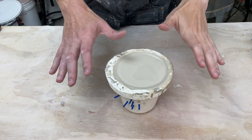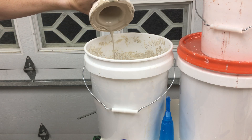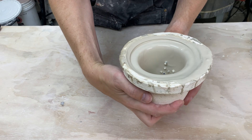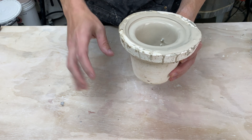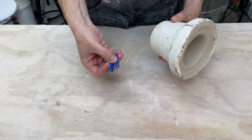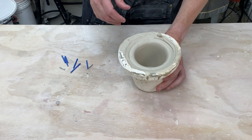The walls have set up — now for the moment of truth. Let's dump it out. We've got a little bit of build-up but it's not very much. I'm going to turn this upside down and shake it a little bit to let it drain. I forgot to show it on camera, but I went ahead and pulled the pins basically right away. And here are the results — let's go ahead and trim it and demold it.